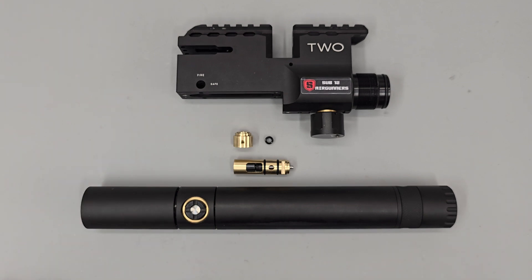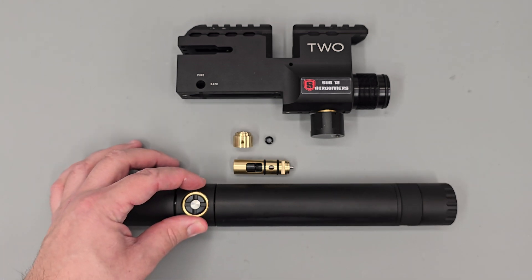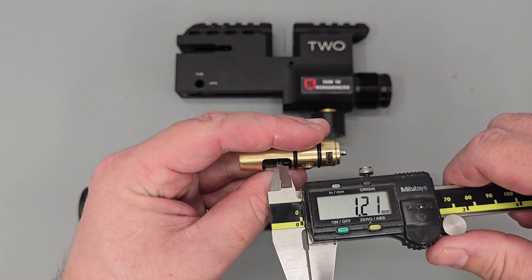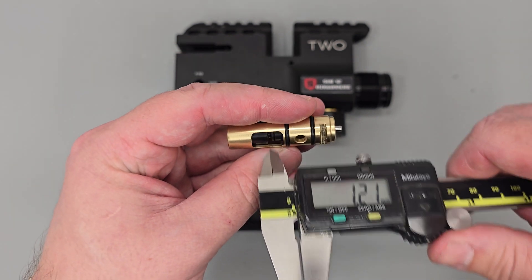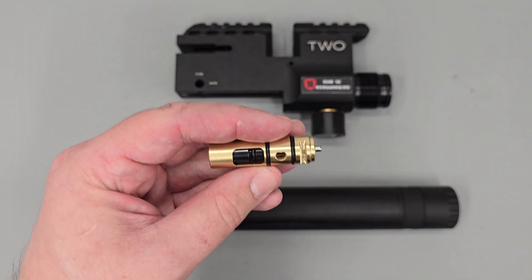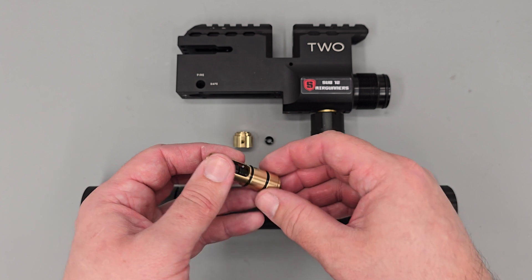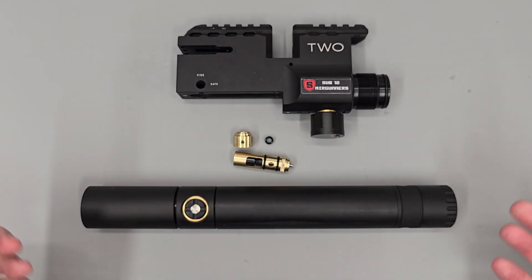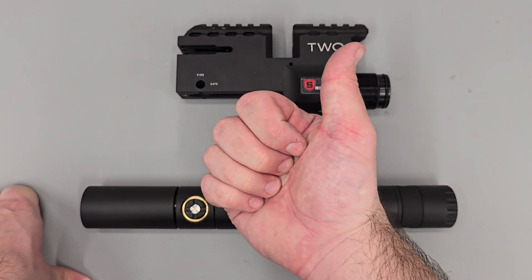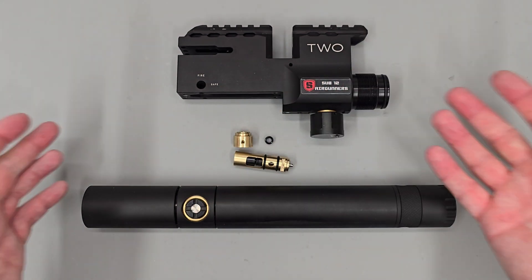There's still a lot more to get out of the new valve — I'm pretty sure we can get a few extra shots out of it, just having to play around with the different settings. The current settings are 100 bar on the regulator pressure, a valve travel of around 1.2 millimeters — that's the distance between the stop and the O-ring — and a hole size in the back of the valve of one millimeter. With that said, I do have a lot more testing to do and I'm sure we can get it even better. But for now guys, that's pretty much going to do it for this particular video. Thank you very much for watching, I hope it's been interesting, and we'll see you in the next one.